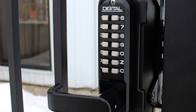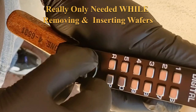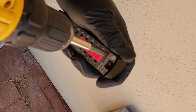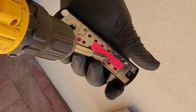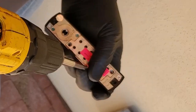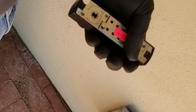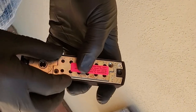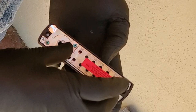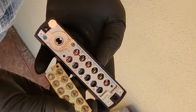So that's how you'll know which direction to turn it. Very important: if you have a C button, press and hold it during the entire combination change; if you don't, keep the thumb turn turned 90 degrees throughout. Now, turn the lock over and remove the two red screws holding on the cover plate. While you're doing that, keep your thumb on the back of the plate because there are springs inside that can pop out. As you near getting it removed, just have your thumb on it — if a spring pops off they're not too hard to put back, but finding them on the floor can be annoying.